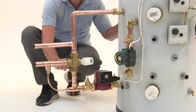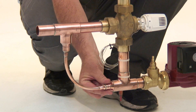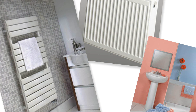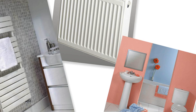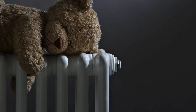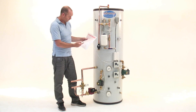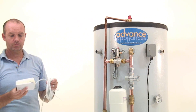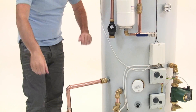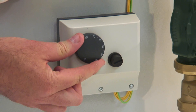Up to the set temperature, water recirculates. Then when the set temperature is reached, it goes back to the stove. I'm going to use an 8mm bypass to make sure there is some flow back to the stove. Which leads me to the heat leak — it must be installed and must be configured to operate on gravity. The heat leak is an appropriately sized radiator or towel rail which soaks excess energy from the wood burner. It's fitted between here and the wood burner — it's all in the installation guide. The thermostat on the loose flex is fitted a metre or so next to the wood burner to sense that it's lit. The tank thermostat will only switch the pump on when the small thermostat has sensed the wood burner is lit and the thermal store is lower than 80 degrees.